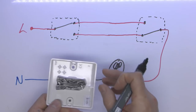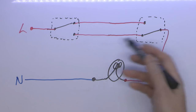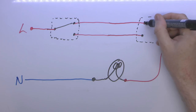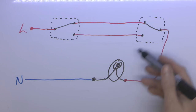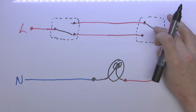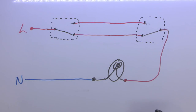And a two-way switch — the one with three terminals — is basically like that or like that. Again, it's only a single button on the front. This is used where you've got two switches for a single light. Again, no neutral there — it's just a line on both sides. In this position, the light doesn't turn on because there's no continuous path for the current. But if we move this one, then you've now got that continuous path all the way through, and the light will turn on. You can turn it off here, but you can also turn it off by simply moving the other switch into its other position, because again there's no continuous path — you've basically broken it at that end. And you can reconnect it by moving that end switch back, re-completing it via the other wire. So you're just using one or the other of these to complete the circuit — each switch can do it independently.